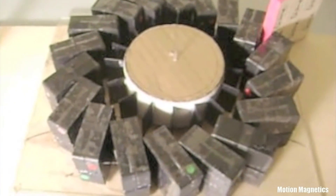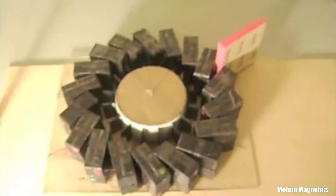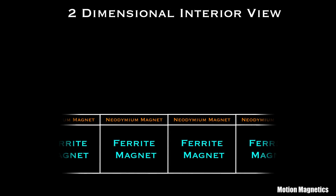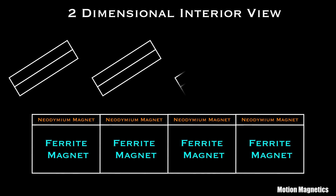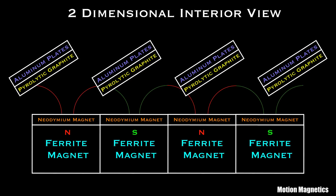If you saw my older video on the pyrolytic graphite rotor, you saw this evidenced by the designs I attempted in that video. I wrapped magnets with their north poles facing each other, in an attempt to use a technique John Bedini used to focus the magnetic spin on a tighter, less arced path. What I realized later is that the pole of the magnet has to be in a pretty direct path to the face of the pyrolytic graphite to slightly move it.